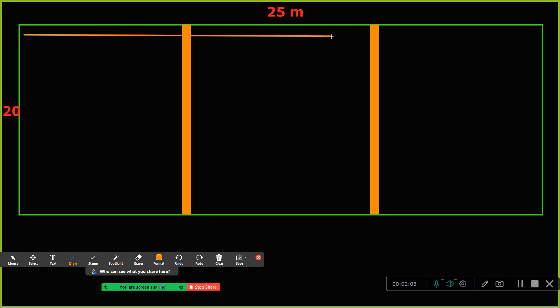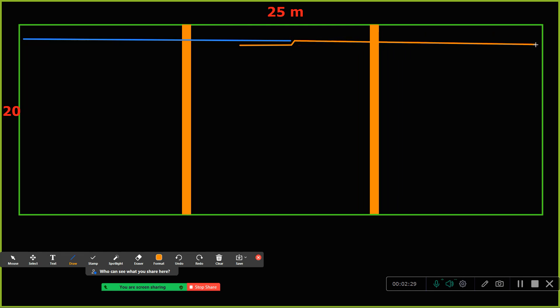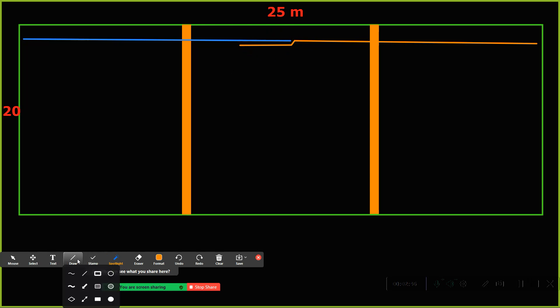Your bar you are going to bring straight. Let us say your 12-meter bar ended somewhere here, because this span is 25 meters and my bar length is only 12 meters. So I brought a bar, it ended somewhere here. Next I bring one more bar and give a lapping there. I cranked it and lapped it — but for the slab this concept doesn't hold good. Why? Because exactly at the center of the slab panel I have done the lapping, which shouldn't have been done. For the bottom bar you should never lap at the center.